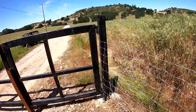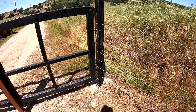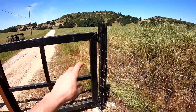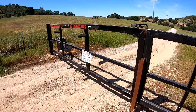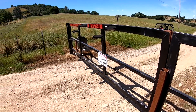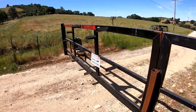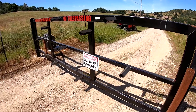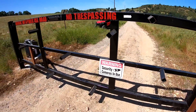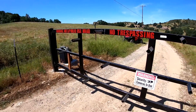We have an additional four feet of secondary gate in case we need to get heavy equipment through — we didn't want to limit ourselves between the poles. This secondary post is four-inch by four-inch by quarter-inch thick wall. It doesn't go quite as deep, and the small gate has slightly smaller hinges, but overall nobody has tried ramming it because there's a pretty serious deterrent.